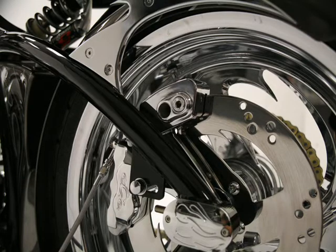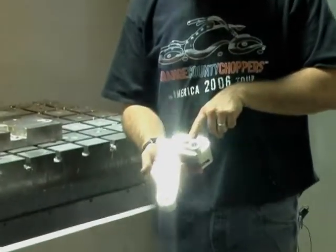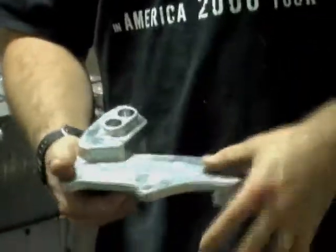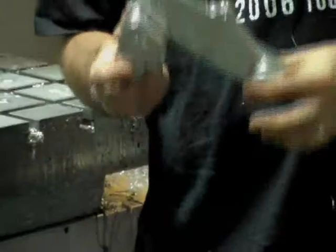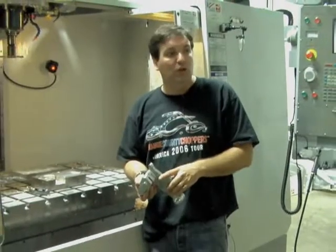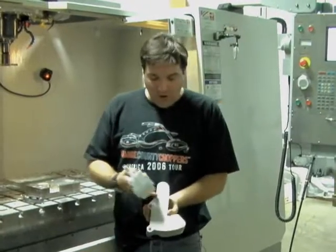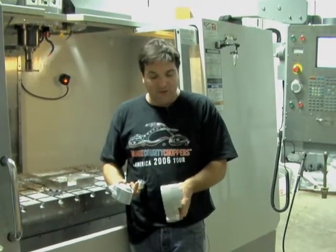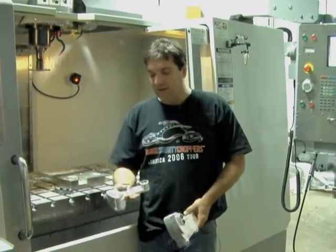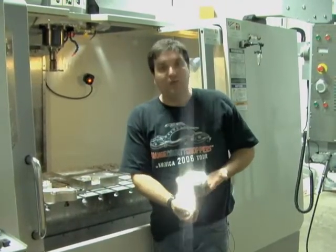This is the road lock device that we're using — axle goes through here, brake calipers mount here. These are the bolts where the locking pin and key switch would go, with the Road Lock logo engraved in. This piece was machined completely here in about 25 minutes from raw billet aluminum that had been cut to shape. You can see when we started off, we had a part water-jetted out from 3-inch thick billet aluminum, programmed to run on the first side, then fixtured up on the second side. We end up with a completed part, ready to go out for chrome.